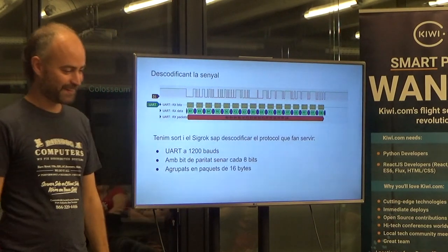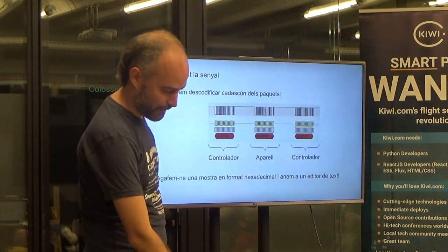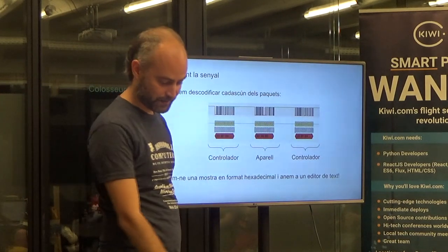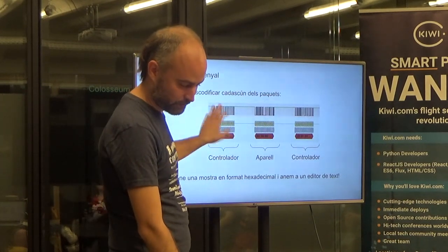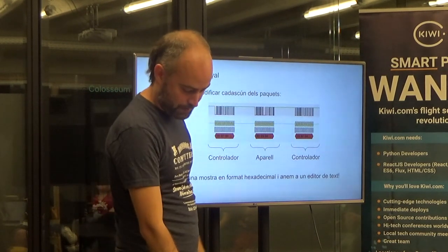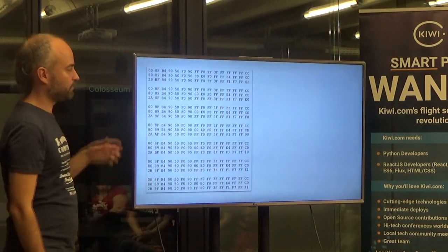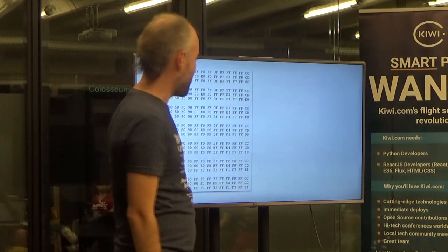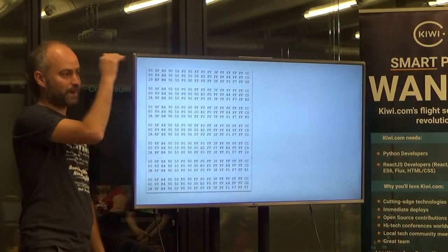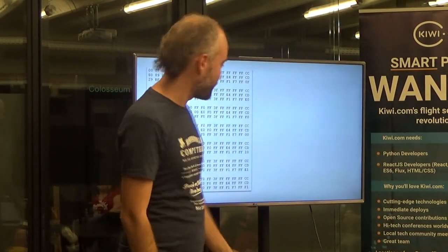Each of the packets — this is something I would have never figured out, but my friend Joan Montserrat, who knows these things, saw this and said 'this is UART.' We plugged it into PulseView and it decoded the data. I had to adjust the bit rate to make it match, but once it matched, all the checks passed. So this was the protocol. For each of these three packets, now we have bytes. We don't need the electronics guy anymore — we can deal with bits and bytes. 16 bytes per packet, and this is the screenshot of it decoding the bytes.